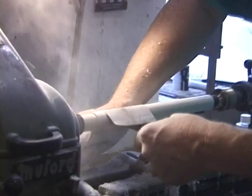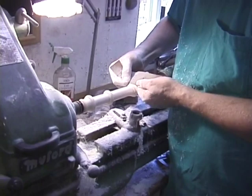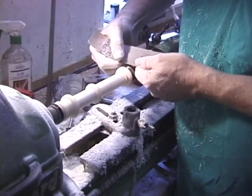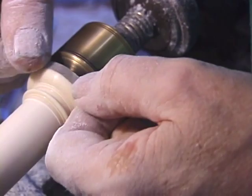A little bit of sanding work here. We're seeing the rough sanding stage, and that would be followed by several stages of fine sanding. But always we want to make sure that our turning is as crisp as possible, because any kind of over-sanding, of course, would decrease the quality of the results, making it not quite as crisp and precise. So we want to get as much form off of the tool so that we only have to do just a very, very little final sanding.